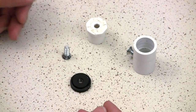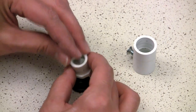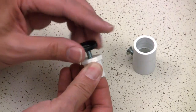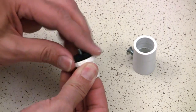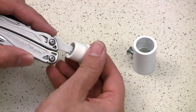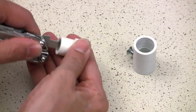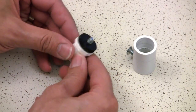Assembly is really easy. You stick the plug here, take the longer threaded screw, and just drop it in the bottom — it's going to stick out. Then you take your knurled large nut right here. You can put it either way; I'm going to do it the other way to get the most surface space on top. Take your flat-head screwdriver, hold the knurled nut and just turn on the threads. It'll go in snugly — there's your platform for whatever you decide to put on this.